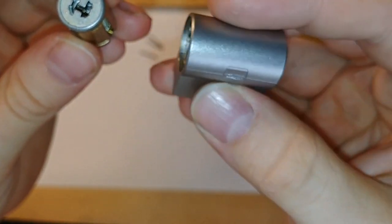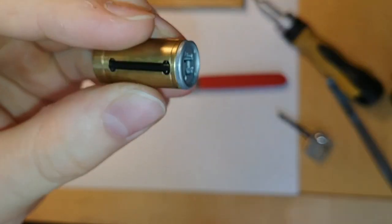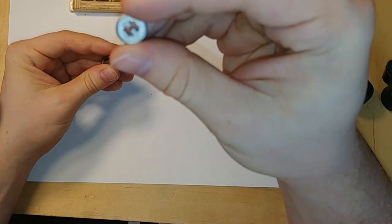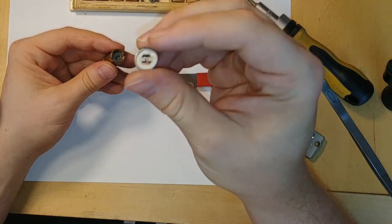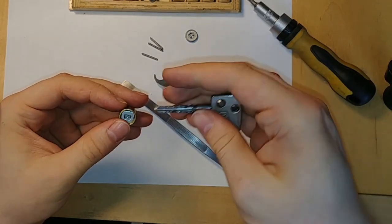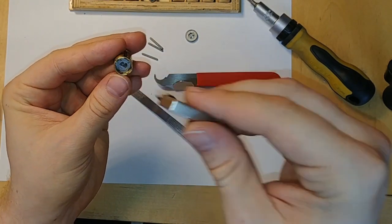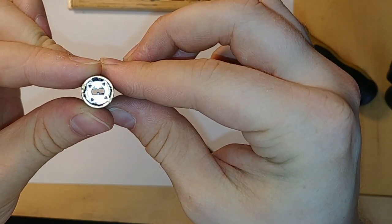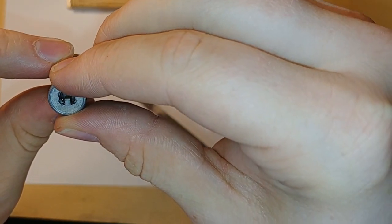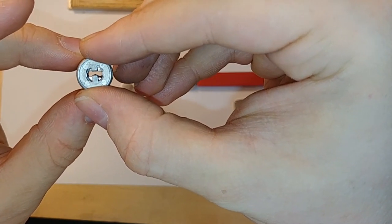The material of this core here is cast metal, cast iron, I think it's called Duracast. And we also have this metal plate here at the front, which is also metal. So let's take it out. That's like a drill protection, and for other forced entry attacks. Then we have our first clue how the picking tip can look like. Let me show this. Okay, so now if we look inside, we can see something. Maybe we also need this plate on top. So we see something like this here. That's the shape of our picking tip that we want.